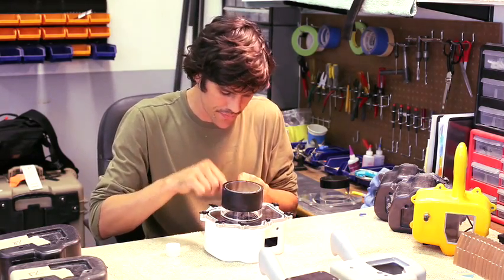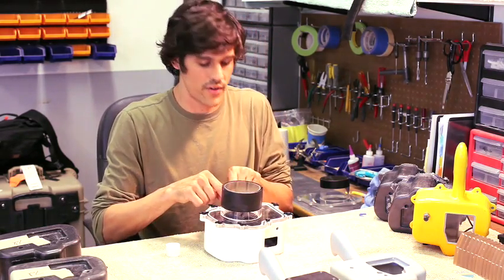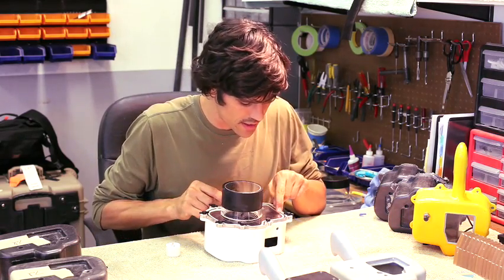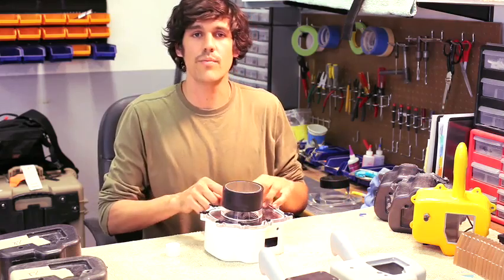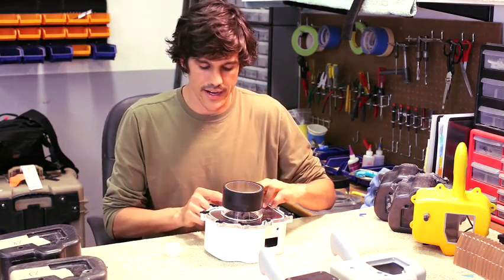Each and every time you use the housing, take a moment. I don't care how good the waves are, but take a moment on the beach. Start at one point on the O-ring and follow that deep dark line all the way around your O-ring groove. That's the one main thing to triple check. Apart from that, you don't have to lube your O-ring every single time, but every single time you do use the housing, check to make sure it's lubed.